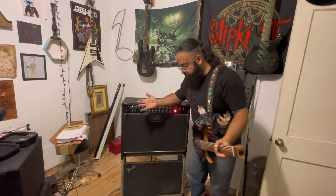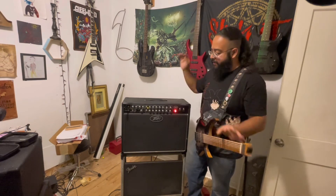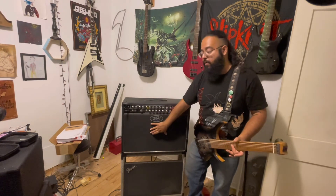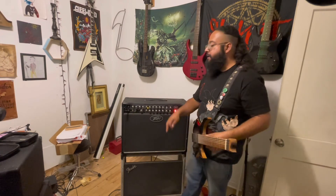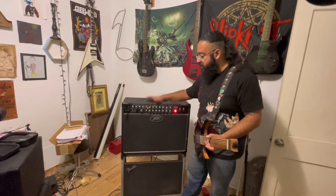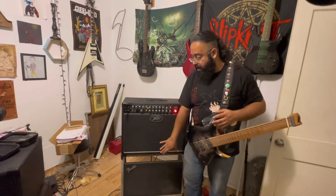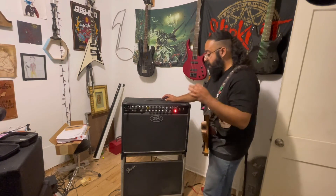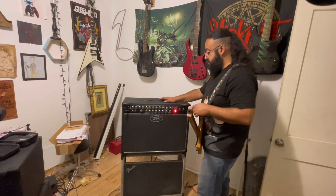I've researched this and did my homework on this amp. The internals on the amp are wired in parallel, so the speakers need to be wired in series. The only way for this amp to be compatible with these speakers is for them to be wired in series. In order to have an extended pull down into these two additional speakers, I've wired those into a series as well. When you get two series-wired speaker pairs and wire them into parallel, it will work with this amp. Make sure your power rating and ohm rating are correct with the output impedance selector — after that you should be good. Lucky enough, I was able to utilize these speakers and make it work.